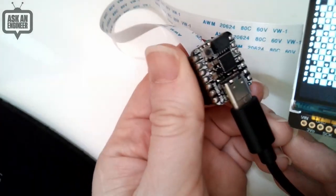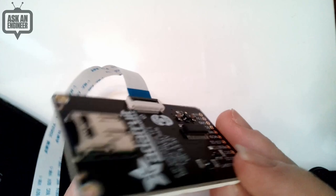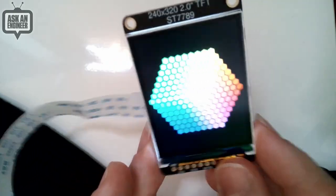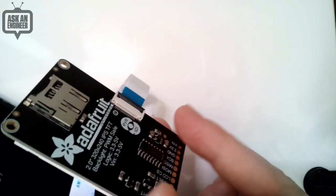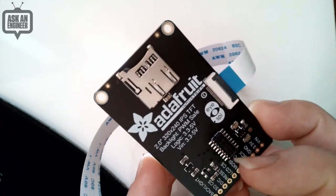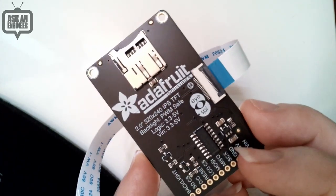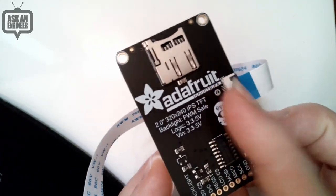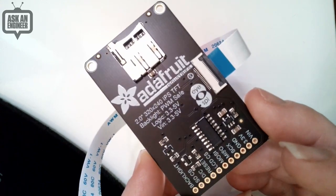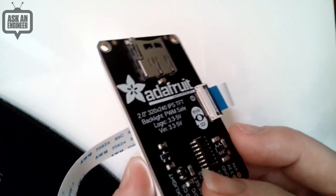I've got a little breakout board to a STEMMA QT, so the display can go anywhere. Easier to mount, easier to wire, basically a no soldering solution as long as you've got the matching EYESPI connector on the other side. Otherwise it's the same pinout display, same SD card, same level shifter. And we also did a nice silk screen as well with Penguin.